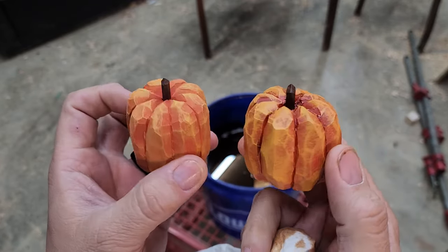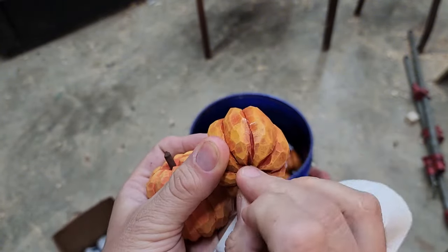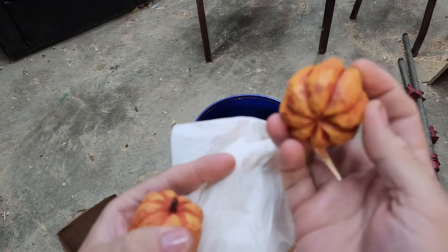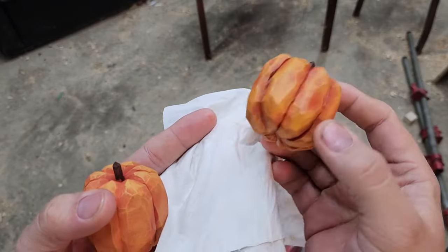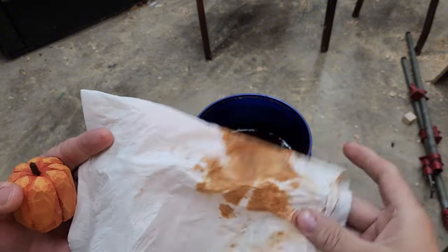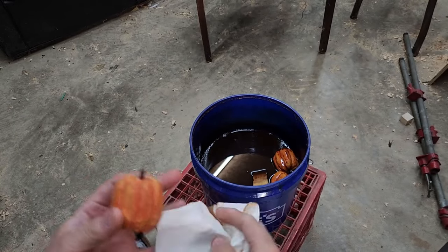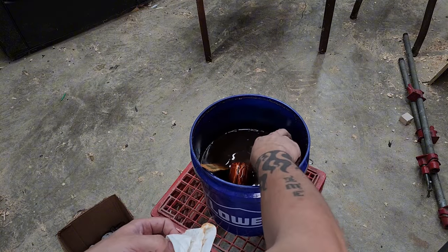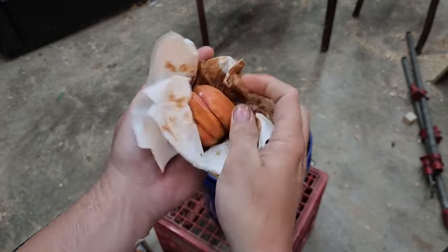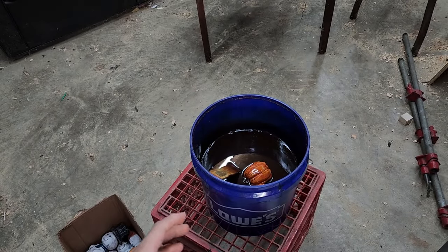The paper towels you're using to dry these off can be a problem. For storage, I don't leave them inside the house. After I get done wiping the carving off thoroughly, I take all the paper towels and put them in my barbecue pit outside. The carvings themselves are still going to have the antiquing solution inside, so I set them on top of a folded towel overnight for about 24 hours so they can drain out and polymerize. That polymerization process really hardens and protects a carving far more than using Howard's Feed and Wax or just a gel stain — that's why I prefer BLO, even though you do have those hazards of the towels catching fire.